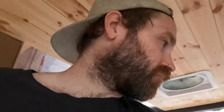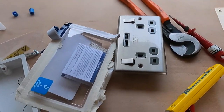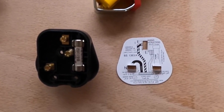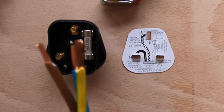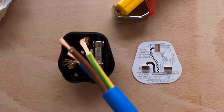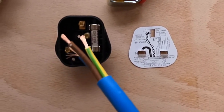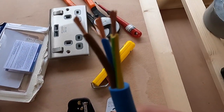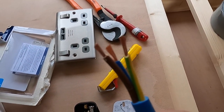Magically I've got enough cable — incredible! So the first thing I'm going to do is wire up my plug socket. Blue wire goes in the bottom left which is neutral, earth goes up the top, and live goes in at the right — and it's got a 13 amp fuse inside. I've cut my cables to length and they just screw down.